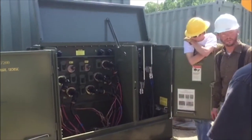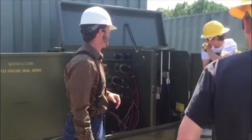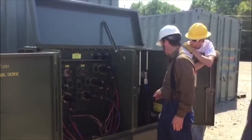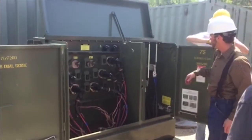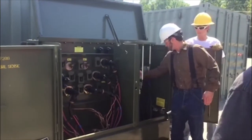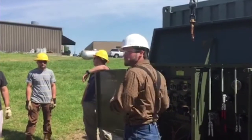Can anybody tell me what the voltage on this transformer is? It's a 75 KVA, but what are the secondary connections? That's right — it's 240/120. This lets you change the voltage that it's set to. Come over here and look at your tap positions, the different positions that you have. Compare that to your nameplate over here. Safety is a big concern, and you are de-energizing it. We're going to lock it out, tag it out, and ground it.